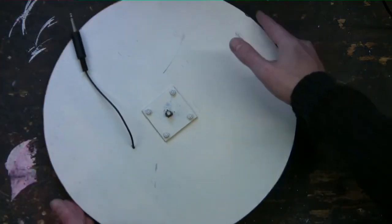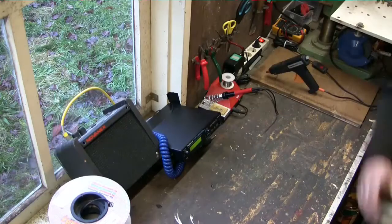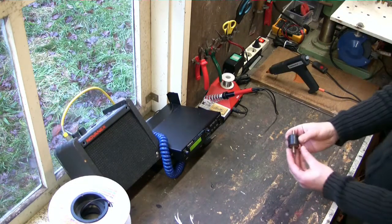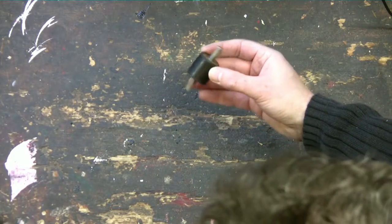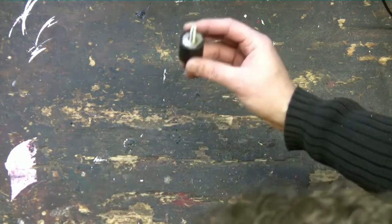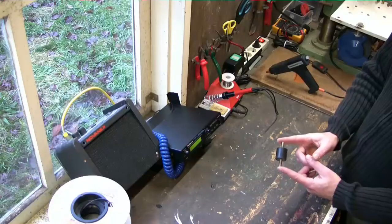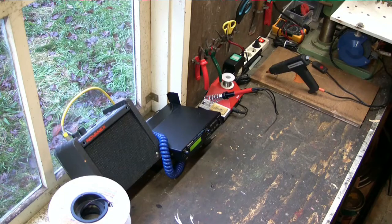The reduction of vibration by the foam turned out to be insufficient, and that's why I started to use a silent block in the mounting of the pad. A silent block is a rubber cylinder with 2 screw threads that are isolated from each other, so vibrations are dampened. You can get them in lots of variations. Most of the time I use the ones with M8 screw threads and 2 male screw threads. I assumed it would prevent crosstalk enough, so I did not need the foam anymore.